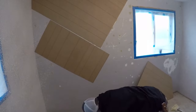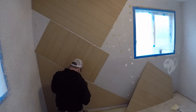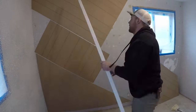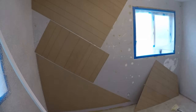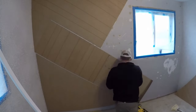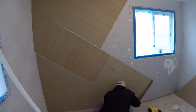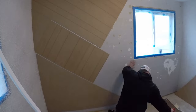With my design, it was all based off of that first triangle on the top — the rest of the angles on the entire wall are all based off that shape. I just picked a random angle, cut it with the track saw, put it up, and then used measurements to fill in the rest of the panels. I had a rough idea of the design I was going for, and once I was able to map it out, it all went relatively quickly. The entire shape of the wall is just triangles, rectangles, and squares — very simple.